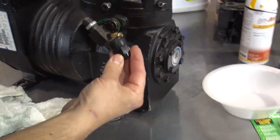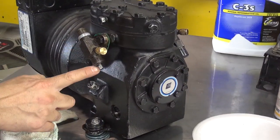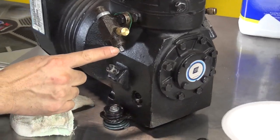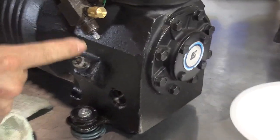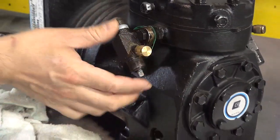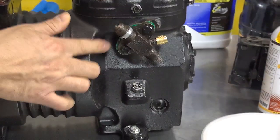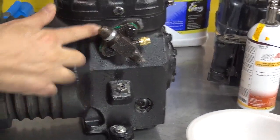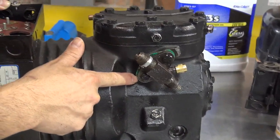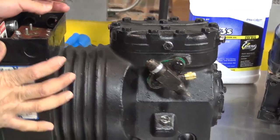And let me tell you something. These caps will stop leaks on the stem of the king valve. All right. And by the way, that right there, that is called a stem, and this is the whole king valve, which you can replace if you need to. The king valve is attached by 2 screws, and it has a gasket that you can also replace. Okay, and which brings me to a little bit more information.